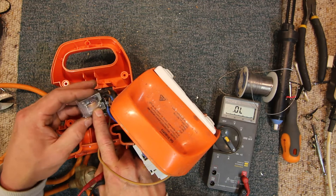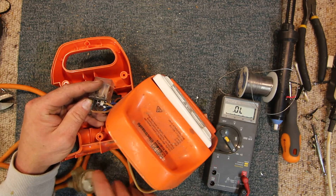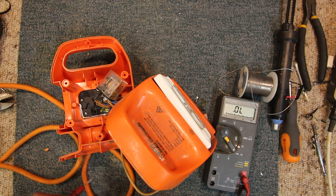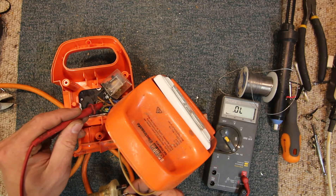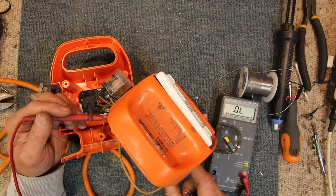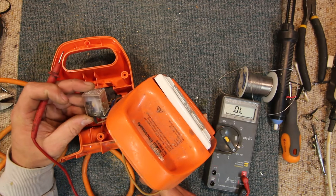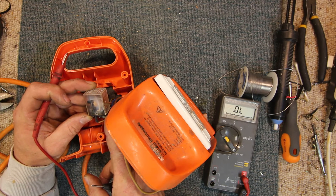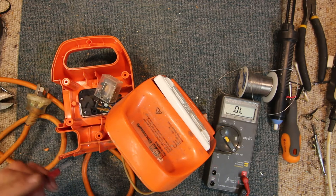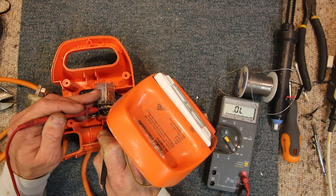I can see AC 220 volts marked on the coil. So the active comes up the lead through the two circuit breakers as you'd expect, and same with the neutral. They've wired it so that when 240 volts comes in and goes through the breakers — if they haven't been turned off — it goes to the coil of the relay, energizing it. That closes the contacts and then outputs voltage to our power points, which without any voltage applied is doing nothing.